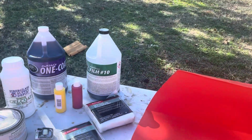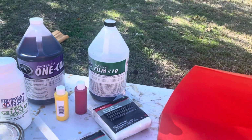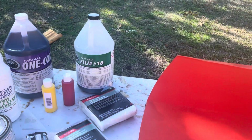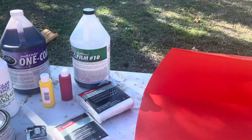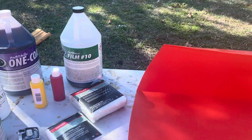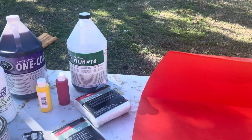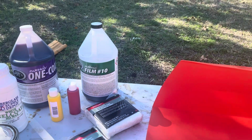One of the problems is when I use the spray on, I actually have a little sprayer that I use to put the PVA on. Because it's a wax surface and it's water-based, it bubbles up or beads up on the surface. So it's really hard to get that first layer nice and smooth. What you have to do is mist it on and accept the fact that it's all bubbly, and then the next layer is the one that smooths it out.